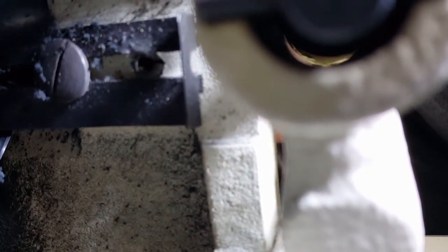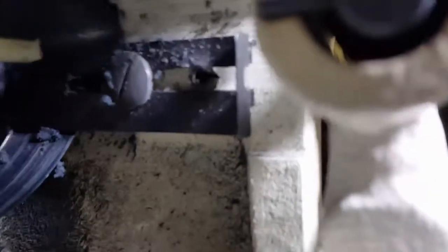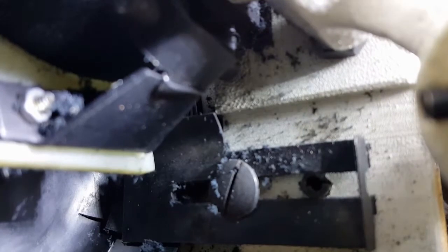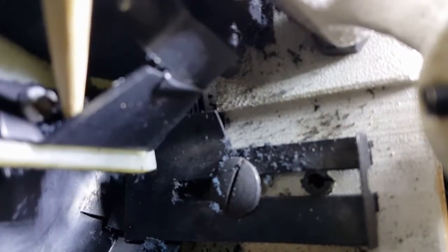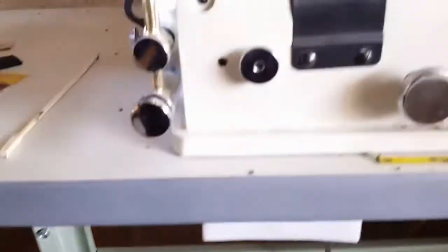As the scrap gets generated you start hanging up and stuff, so you want to find the best place for it. Now, an interesting thing this machine has is a wiper. Here it is — this device here — and it's on a spring, so it kind of pushes the scrap away and down so that it falls into this little hole here. Then coincidentally that hole goes through the table and into this little drawer, which is kind of nice so the junk isn't falling on your foot.